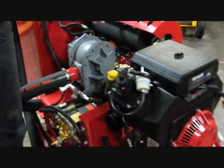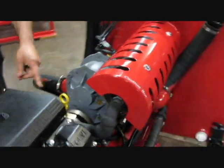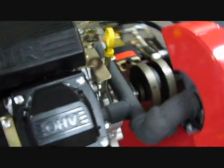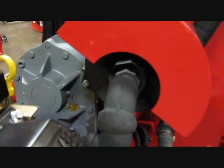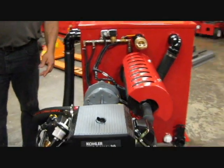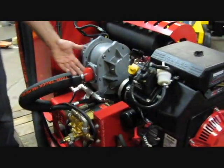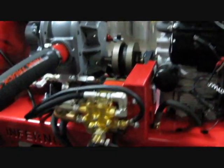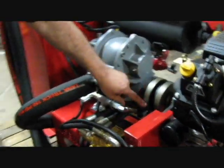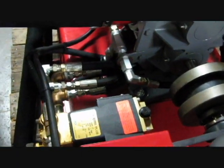The whole system is equipped with the single heat exchanger, and just like the other twin cylinder design that we have, we have joined both cylinders together to spread the maximum BTU of exhaust into the heater to create a constant 200 degree water temperature for cleaning carpet, tile, and garden furniture. To the right side is a very accessible pump — you don't need to remove any panels to check the oil. You can simply reach in to check it, and you'll even be able to rebuild the pump while it's on the machine.